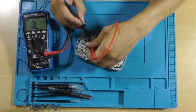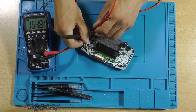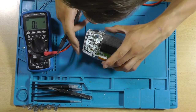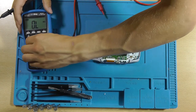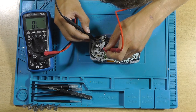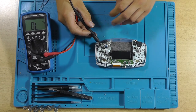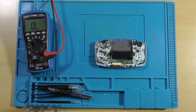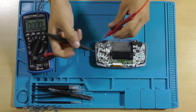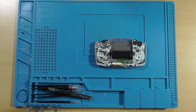Let's measure this — oh, it's even less now. This one's dropping. I don't know what this capacitor is, but I think it's bad. Let's check if they're connected to the same rails — no, they're not. I think the capacitor is really messing up my measurements, so I'll try to see if we can measure its capacitance. But I think it's probably good practice to remove it in order to see what happens.